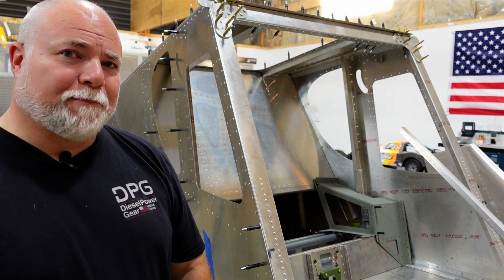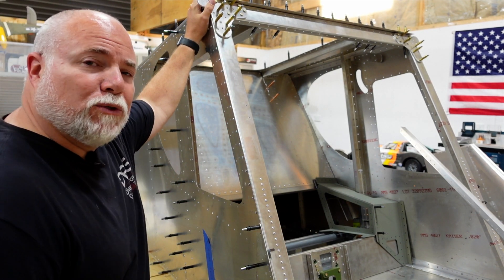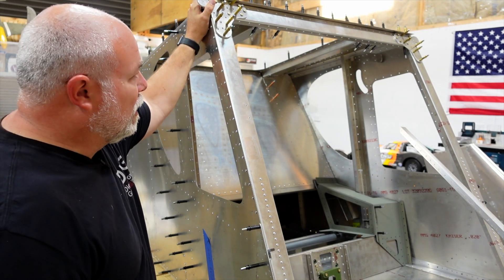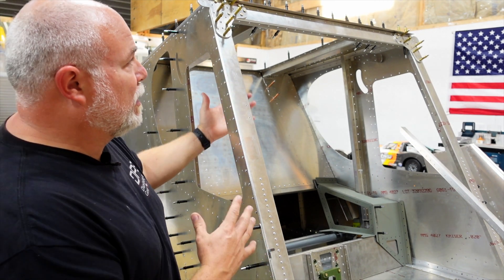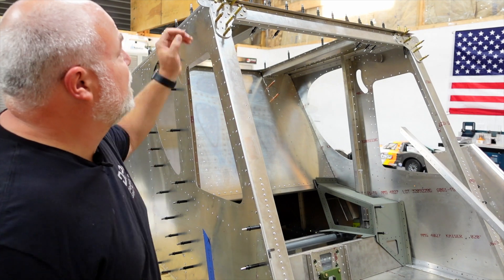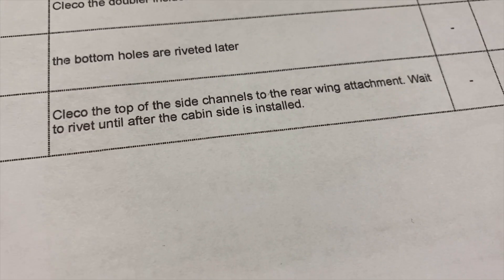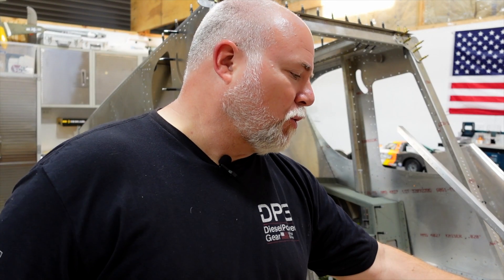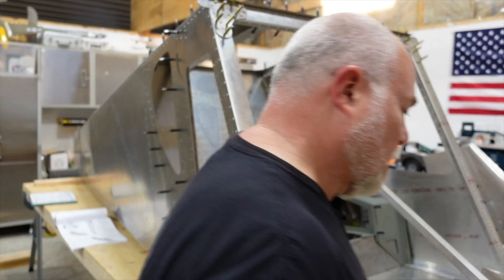I messed up guys, I messed up big time. In getting prepared to join the front and rear fuselages together, following the plans it appeared that this front archway stayed together because of just the natural way it all fit together and how you rivet the top cross members. There was a note about clecoing this top section and leaving it clecoed until the sides were on, but that was kind of unclear. Long story short, you cannot join the fuselage — which is sitting right here next to me — you cannot join it with these on there.